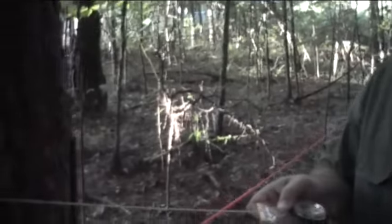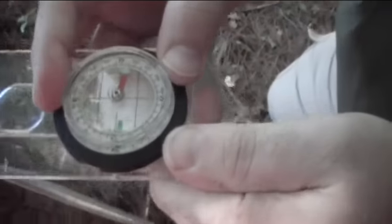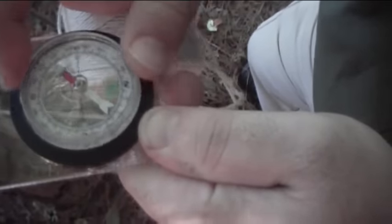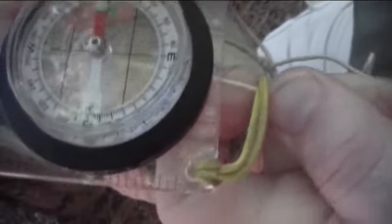Something about the property surveyor tape and me just don't get along, so we've gone back to a cotton twine. We've run this straight east on a 90 degree compass bearing from the corner of the shed going straight through the woods. If I turn the compass now and put my bearing at 270 degrees straight due west and line up my line right under it, you can see that the white cotton line goes straight due west to the property line or to the shed corner. So now all we're going to do is take this metal pole — we know right where this corner is — and sink it right in this corner so we know where the corner of this fence is going to be.